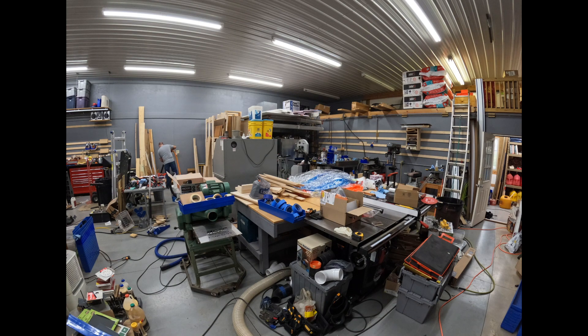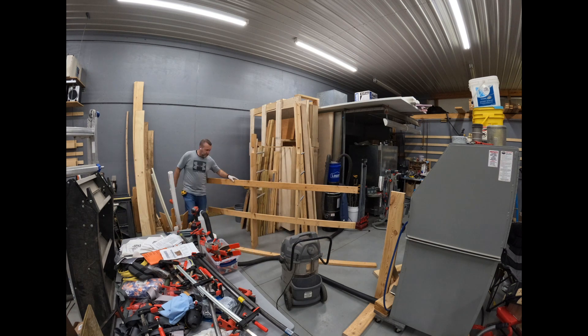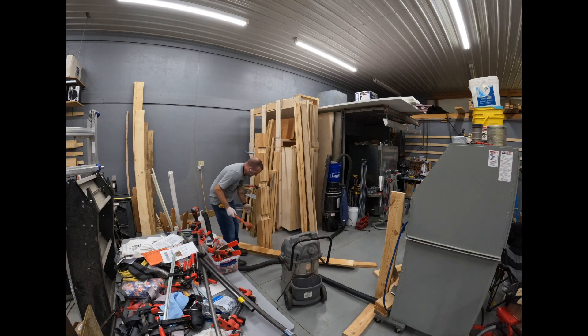The modifications we're going to do are bore some more holes so we can put in more pieces of conduit, and then I need to dado the backside — actually cut away a chunk — so it'll sit over my 2x10 header that splits the wall.